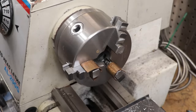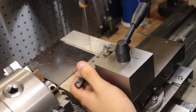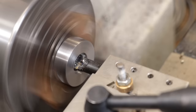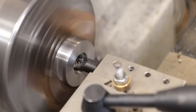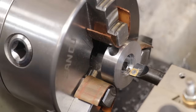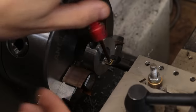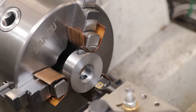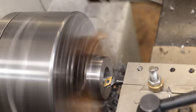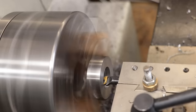And finally it's back to the lathe to bore out the recess for the button die. Now one thing I didn't count on was that this operation was a real insert killer. I know carbide doesn't like these types of interrupted cuts, which it certainly was here, but normally they last a little bit longer than what I was seeing. I probably broke two cutting sides in the space of a minute. I don't have a high speed steel cutter in the correct size, so I simply swapped out to a different type of cutter and it seemed to work.